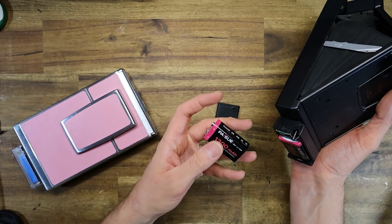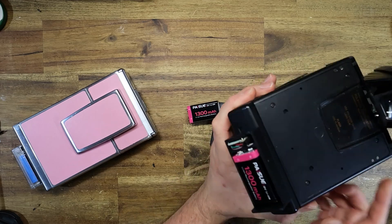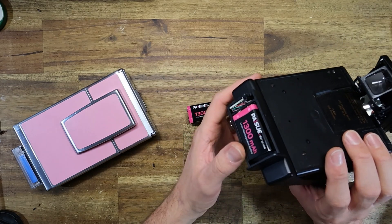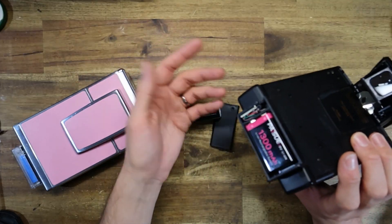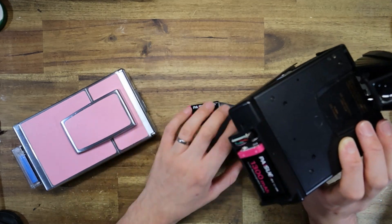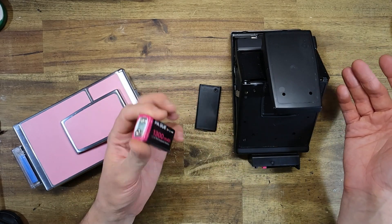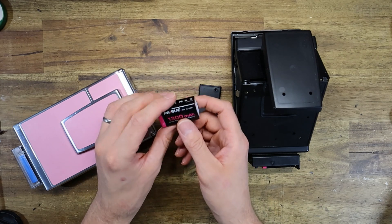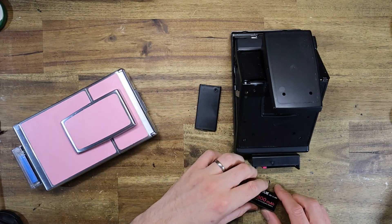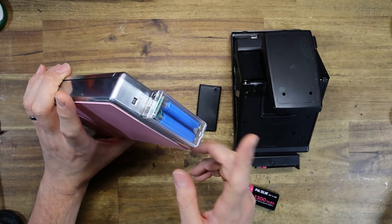So I would say this would be a pretty similar ordeal. Another advantage is that if you are out in the field and the battery blows up for some odd reason, you should be able to put in an alkaline battery cell instead, and it should do the trick at least for a few packs of film, because it'll basically convert that 9-volt alkaline down to a very steady 6 volts. 9-volt batteries are a very common type — you can pick them up at any hardware store, most pharmacies, supermarkets, even gas stations will carry standard disposable alkaline 9-volt batteries.